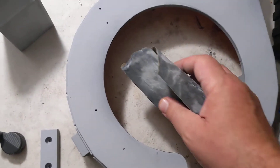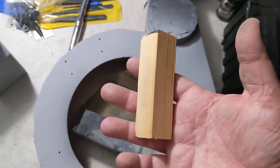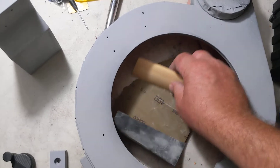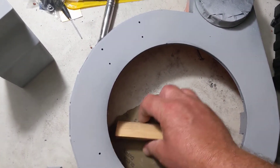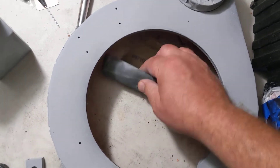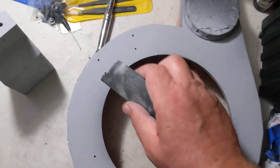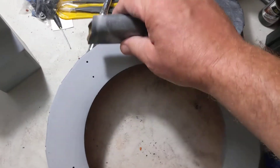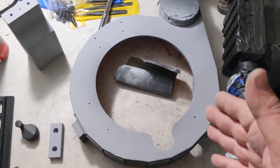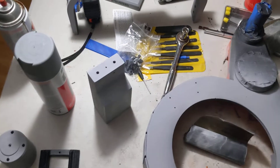I'll just try to take this out here. I use — and this was a happy accident — I use quarter-round molding, as big as I can find it, and then I wrap that in sandpaper. You want it tight to the thing and then you're going to hit it that way, that way, that way. Also reduce the grit: I went from 80 grit to 150 grit to 400 grit before I put a coat of primer on. That's a pro tip — that's something I do.